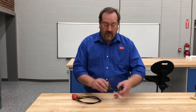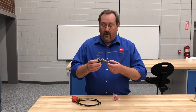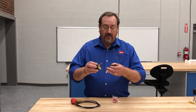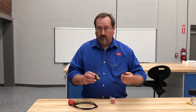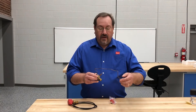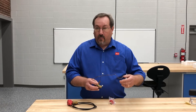Everyone's familiar with the old thermostatic expansion valve, TEV or TXV, and the way they work is they modulate the refrigerant flow through a bellows and a bulb that has refrigerant in it. When the refrigerant heats up it puts pressure on the bellows and meters the refrigerant, but it is almost always in at least a slightly open position.